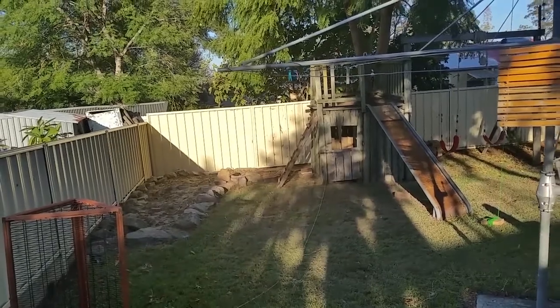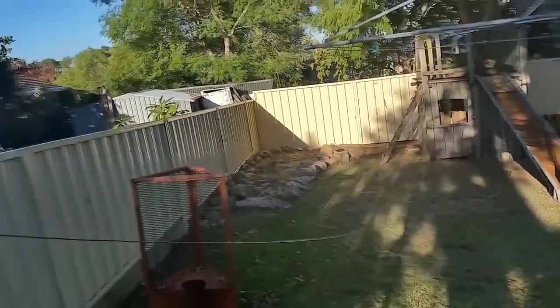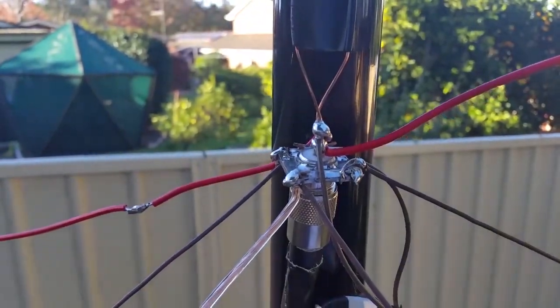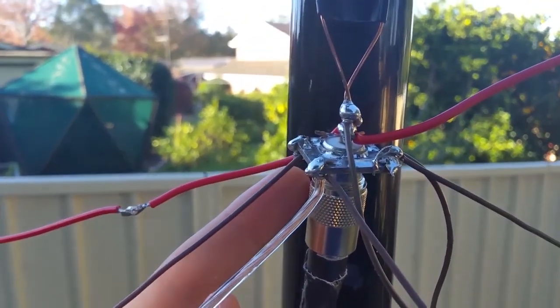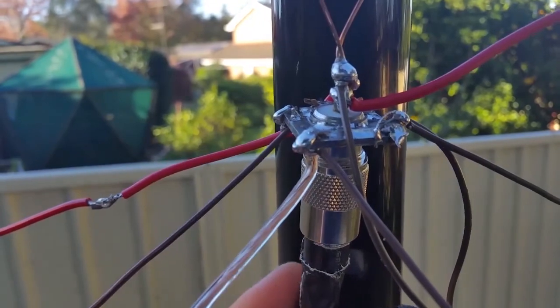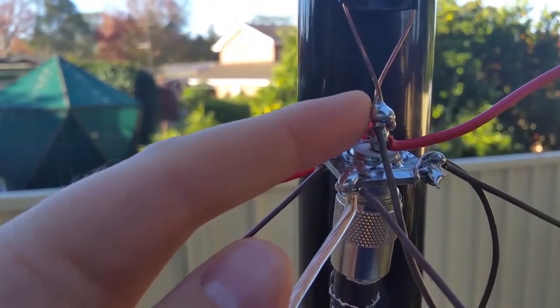I love this backyard — it's very amateur radio friendly. Lots of nooks and crannies to secure your wires from. As you can see here, it's very quick and very simple, just going into an SO-239 connector. The counterpoise wires are on the inactive part of the antenna — the ground or the braid of the coax — and then you've got your active part right here.